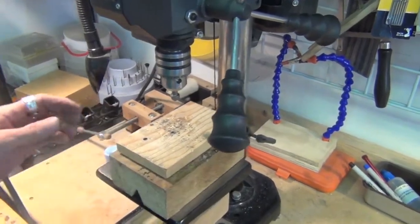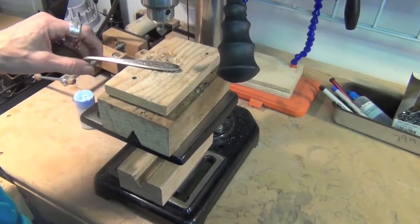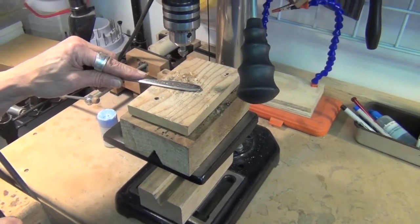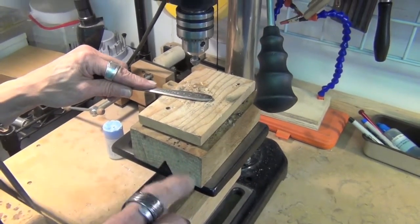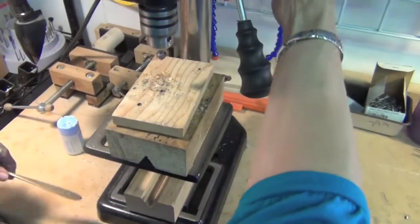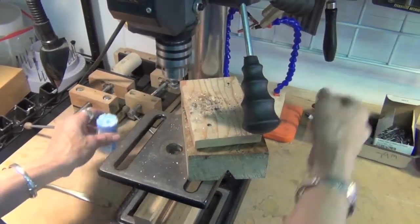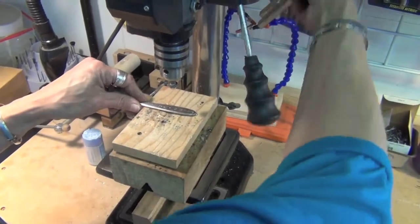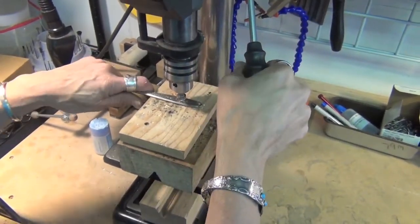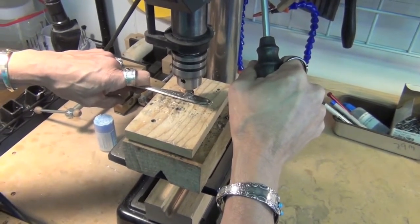You do not want to go too deep too fast, because if you create too large of a pocket it's going to either fall through, or the hole is going to be too big and it's not going to look correct. So we're going to put a little bit of cut lube on the chamfer bit and do just a little bit, then try and fit it to see how it looks. If we need to do more we can come back and drill a little bit further.